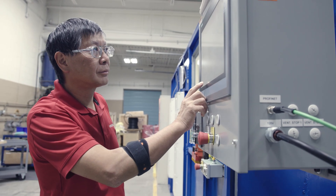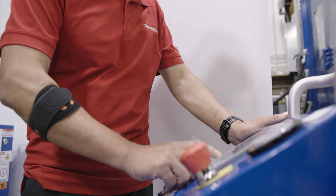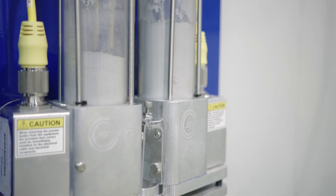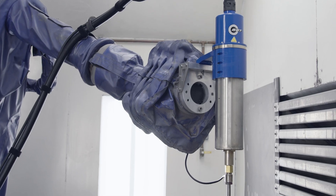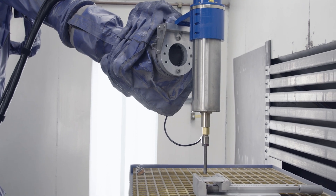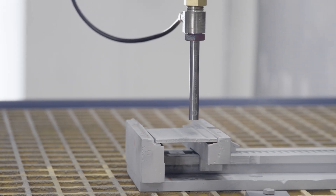This has been really the most advantageous aspect of the equipment. It has allowed the industry to get away from helium and move to a more nitrogen-based or air-based powder spray system. It also allows you to go out to the aircraft and do repairs at the source of the damage. One of the benefits of our new powder feeding technology is that we can feed powder at very high travel speeds — with the new technology we actually see a continuous, very straight-line deposit, even up to 2,000 millimeters per second.